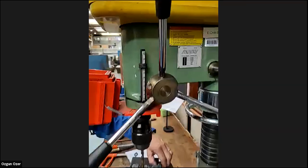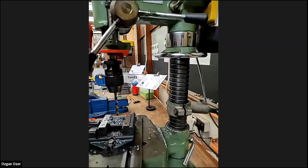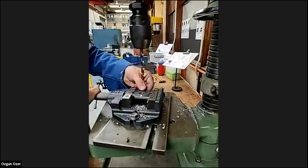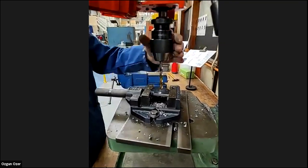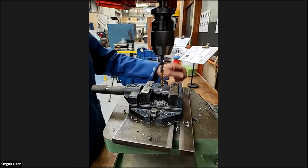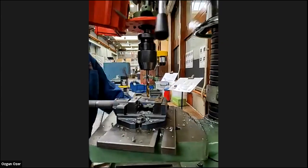So now this is okay? I've just realized what it was. It was actually the stop. There is a stop on the side. It doesn't allow you to go more. So it was preventing us from going through. Okay, so what we can do is go back to our room. We started to drill them. Somebody must have set a stop doing a job in between the lab class, because they can use these drills for other jobs. I'll remember that next time.